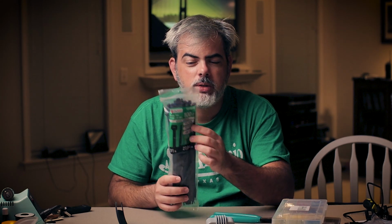We have some brass washers and a couple of number 10-24 brass nuts to secure it all together. Then we also are going to have some zip ties. When you use zip ties outside, you want to get the black ones, they're UV protected, a little bit of resistance. These I think actually came from one of the big box stores, you know, Lowe's, Home Depot, whatever. And we'll need some strippers. Everybody likes strippers, but this probably isn't everybody's favorite kind. This is for stripping wire.